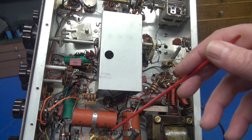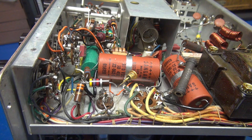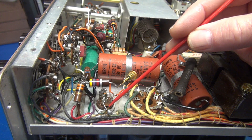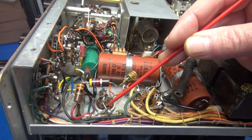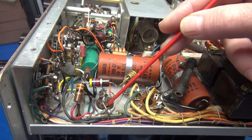Let me take you closer into this area down here by the 6X4. We'll take a look at somebody's attempt to solid-state that DC supply. Here's a close-up on the power supply section — somebody's been busy doing some mod. Normally these Navigators work great as designed, so I need to reverse all this. Here is a close-up on the 6X4 tube socket. You can see one of the lugs is missing. We've got a diode hanging in the breeze with a wire feeding the 4.7K resistor, and there's a splice job of three wires all joining together. I do not feel comfortable powering this radio in this configuration.